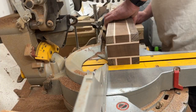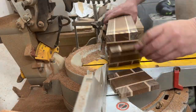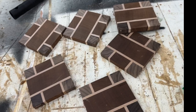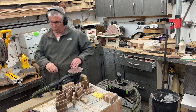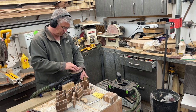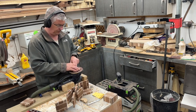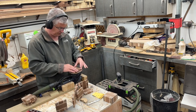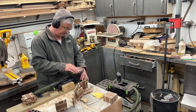I ended up making a jig for cutting these with a zero clearance backstop to help with breakout. As you can see, you can just put them on the mitre saw and cut them through — they come out good for sawn timber. After all the cutting it's then my favorite job: sanding. There was quite a chunk of sanding with these, but the more effort you put in the better the finish tends to be. Because the chop saw had a very new blade on it, I didn't have an awful lot of cleaning up to do.